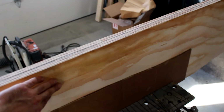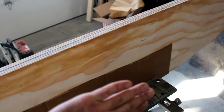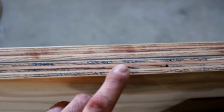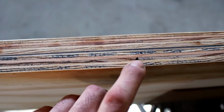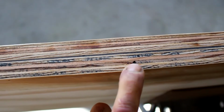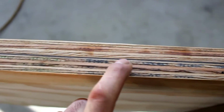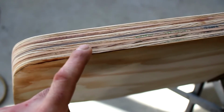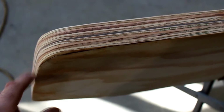This will get the chop strand on it and get clamped onto the back of the boat that's covered in resin. But I want this edge to be very much sealed, and there's at least a couple spots where there's a small void in the plywood after I've cut it. Nothing where I laminated it, but still I want everything filled and really sealed.